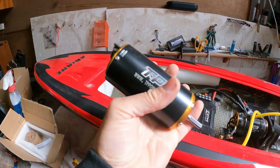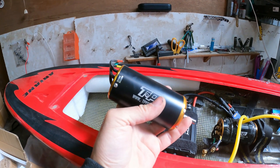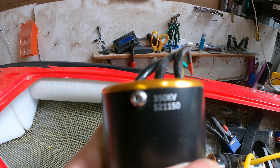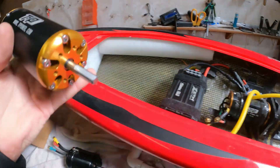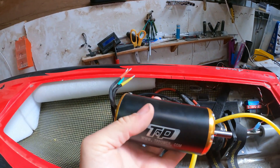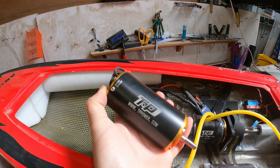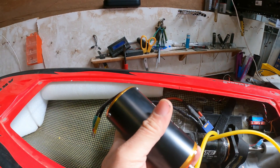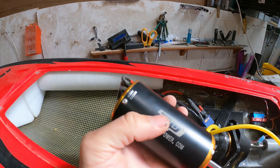The lowest big motor TP make in the catalogue is 600kv, but I asked nicely and got them to make me a 350kv. This is 110mm long — so going from 60 to 90 to 110 — which is more what the jet people suggest. It's also a D-wind motor, which is going to be more torquey, which is what I think the jet needs. Plus TP were kind enough to make me one of their special ones that they don't really talk about, but it has more power than the rated spec.